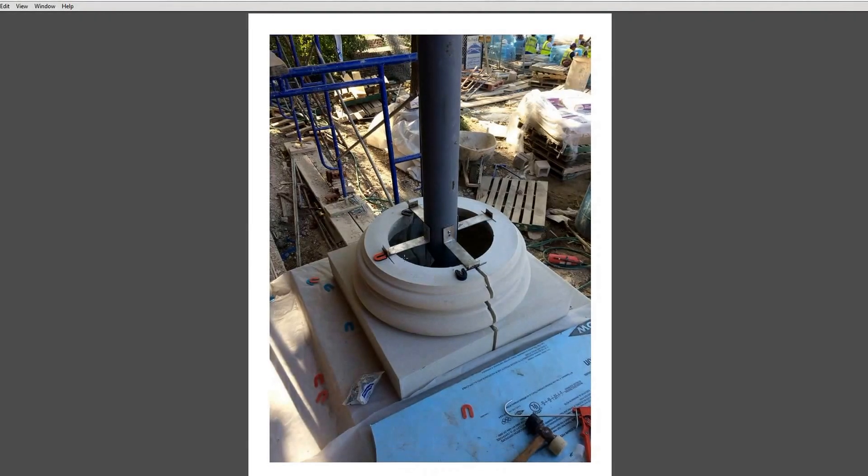This photograph shows pretty clearly what we were just looking at - a kerf was cut in with a masonry diamond wheel, so the bottom part of that clip is catching on to the column base, and then the upper tail coming up out of the clip is ready to accept the column shaft.